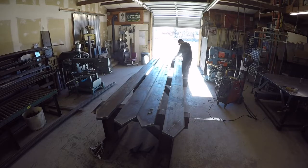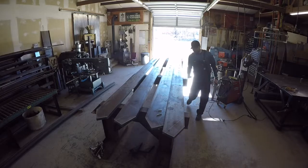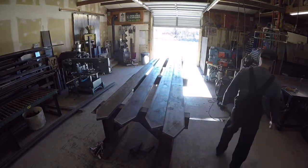Hey guys, Matt here with Matt Co, and this is part two of our stringer build. We're building stair stringers — these are the long ones. I'll maybe do a video on some of the short ones, same thing just shorter. These are 20-footers, so this is your single stair stringer that goes from first to second floor, or like a basement to a first floor depending on the layout. To get to other floors you have what's called a switchback. Here I'm laying it out using the framing square.